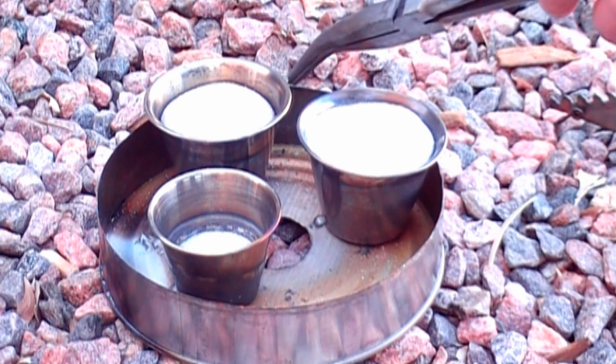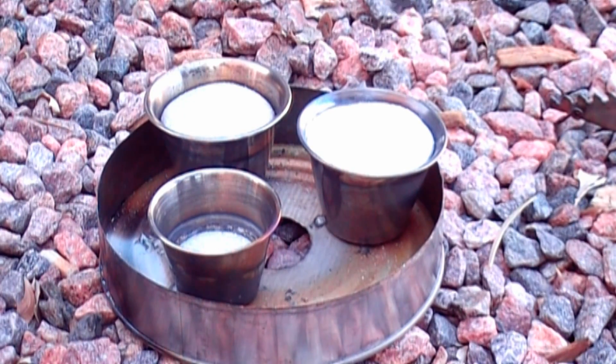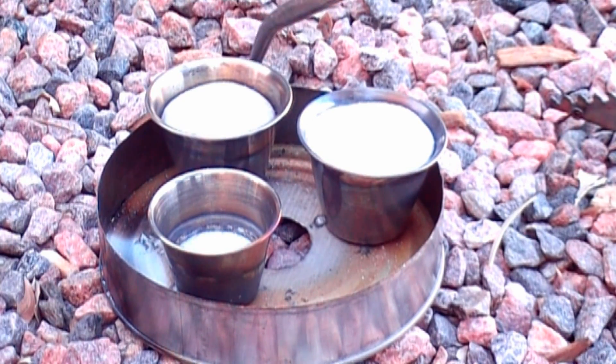When I was pouring the molten aluminum from the crucible, it's got really high surface tension. I need to figure out a better flux or actually figure out how to flux it properly — I think that's what's keeping the surface tension too high. It gives the appearance that the aluminum isn't hot enough and so it's all thick, but judging from how it's still liquid, that was plenty hot.